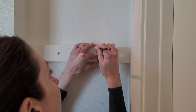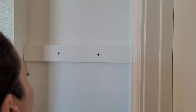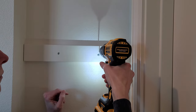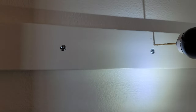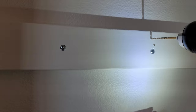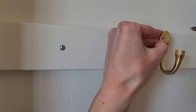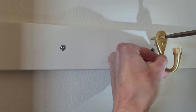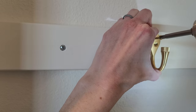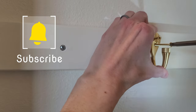Go ahead and mark your pilot holes — I'm just lining up the top of our hook along the top of our board, but it really depends on what hooks you use and how wide your board is. Use a small drill bit to make sure the screws will still grab; you're just doing a pilot hole to prevent cracking. On the left side I know there's a wall stud back there, so I'm going to pilot hole all the way through to make sure those long screws can get all the way through. Make sure you check your torque on the drill gun because you definitely don't want to strip out these screws when installing the hooks.